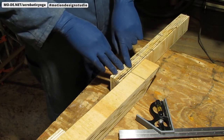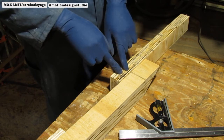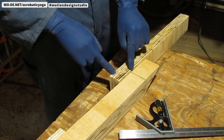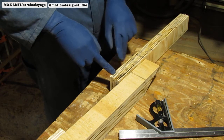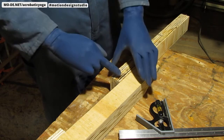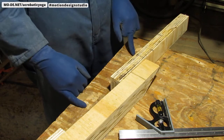from the 2 inches on out to here, this line right here, I need to remove all the material underneath right here, up to 1 inch. So from here to here, I'm sorry, this line right here, from here to here, I need to remove 1 inch of material. And if that goes well, this should be glued onto it, and then that should brace the piece, okay?